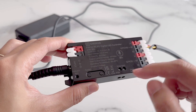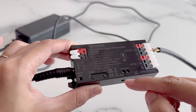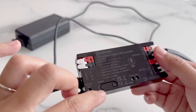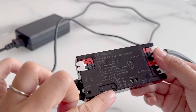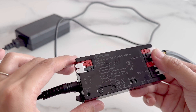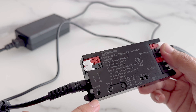On the bottom IO33 port we have metal screw type connectors that can plug in a mic or an audio line in. On the bottom left-hand corner we have a restart button to restart the controller. We also have an optional button which can be programmed inside the WLED app. The bottom left has an indicator to show if the controller is powered on and ready.